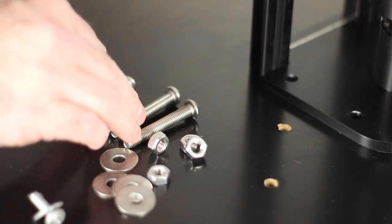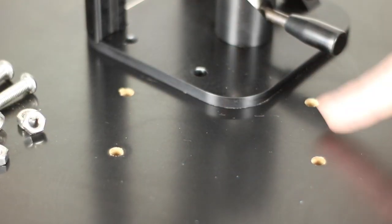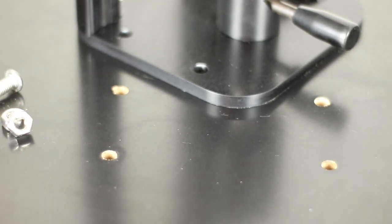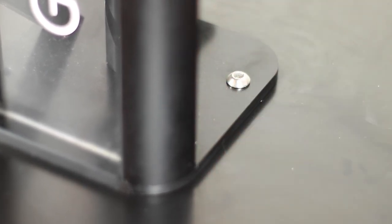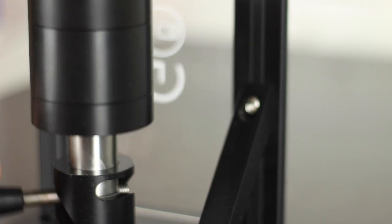I need my four nuts, bolts and washers. I then drill four holes to match the hole template of the unit, fix each bolt through the holes and tighten with the nuts and washers underneath. The base plate can hold either the 440-millilitre spacer or the 330-millilitre spacer.